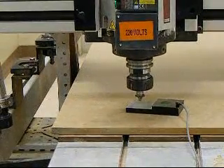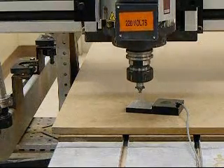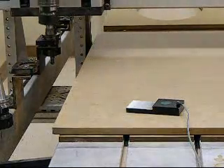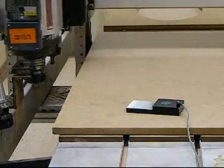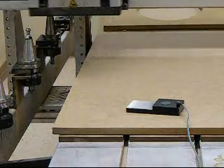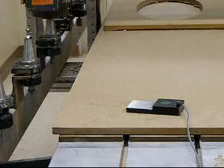See how it's important to have the longest tool in the turret first — because if you touched off a shorter tool first, there's a possibility that as the machine is jogging down to get to the touchpad location it will go too fast and break. So it's very important to use the longest tool that you have for your first touch-off.